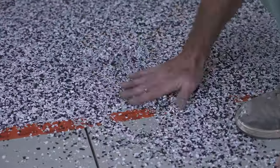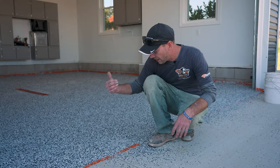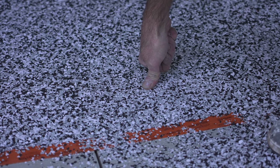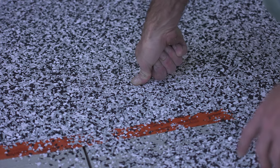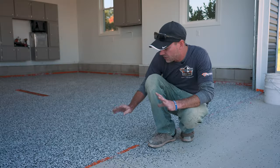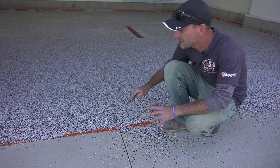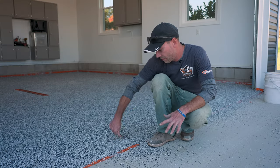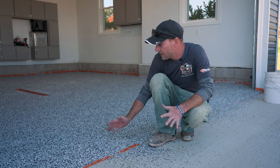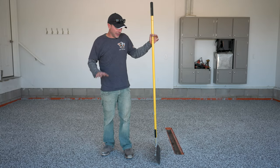Brush some chips off with your hands and then take your thumb, push straight down on the chips, put a little bit of pressure on it, and give it a twist. This tells you how hard the coating is. Right now I can feel it slightly twisting under my thumb and I can actually see some stickiness — that's not quite ready yet. If it's nice and solid, then you're ready to go. I did no damage there, so I'll give it maybe another half hour and then we'll check again and get started scraping.